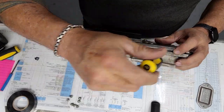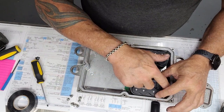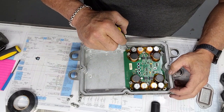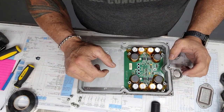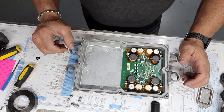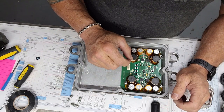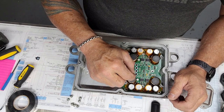You'll need a screwdriver to get in between the crack, separate that out, get that off. These are two T15s that hold these little covers on, and then you have T15s in here — there are seven of them. There's some goopy stuff that typically occludes them. You've got to be real careful cutting out that orange amber-looking stuff. I think it's just vibration dampening, but be very careful when cutting it. If you're using a chisel tip, you don't want to damage the components underneath. Identify a clear space on the board where you can cut and clear it.